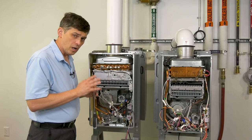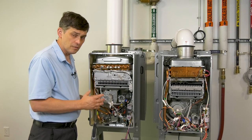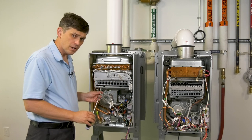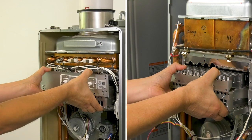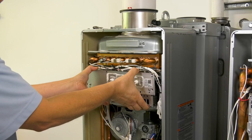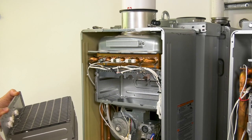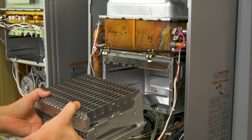Finally, after all of the screws are removed around the burner box and the manifold plate is out of the way, there are two final screws in the very back of the burner where these notches are — you will need a longer screwdriver to remove them. Gently pull the burner toward you and be careful with sharp edges. Notice how newer RE models have the sight glass plate attached to the burner, where on older models such as the RL it is separated.